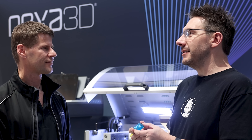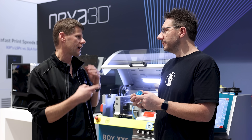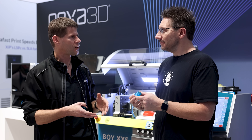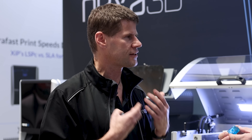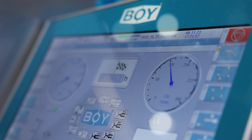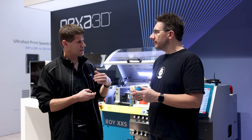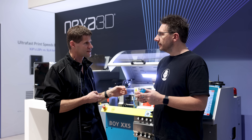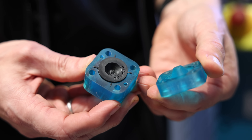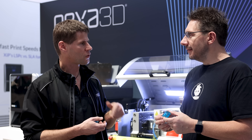The dollar savings is an amazing proposition — but also time saving. And keep in mind that every time you start cutting into metal, you're consuming a lot of energy and a lot of environmentally costly material. We had an LCA analysis done that demonstrates freeform injection molding is 75% greener than conventional pilot tooling when you're in development. Once you get into serious production, injection molding is the greatest technology there is, but for sustainable development you need to get those metal tools out of the first few iterations — cutting a new tool every time is not only expensive, it creates a lot of waste.